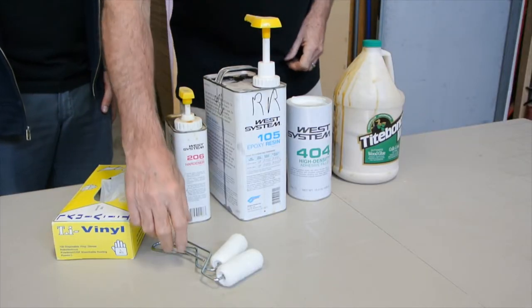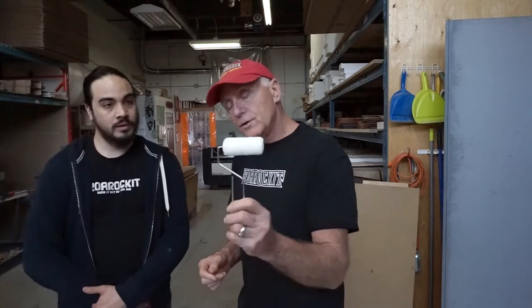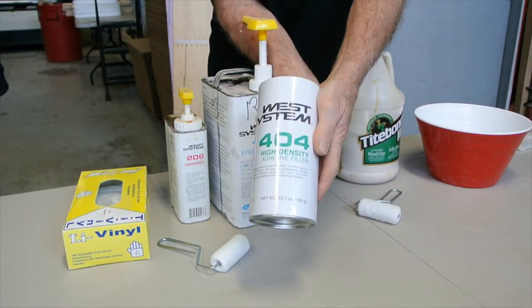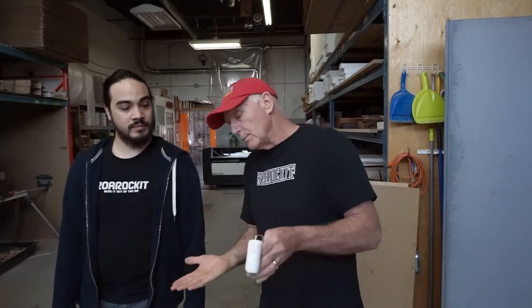Two hours gives you plenty of time to get the material rolled onto the veneer and into the bag. When using this material, you want to use a roller and apply a very even but fairly heavy coat of epoxy over the entire surface before putting the layers together. This epoxy is fairly thin, so I like to add an adhesive filler to thicken it up slightly. Instead of the epoxy soaking all the way into the veneer and leaving nothing on the surface to bind the layers, the filler thickens it so it floats on the surface and actually bonds the two pieces together. You don't have to add a lot — a couple of teaspoons will do.